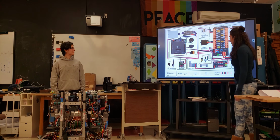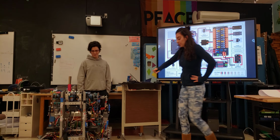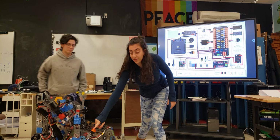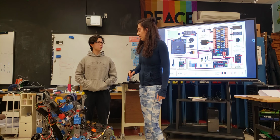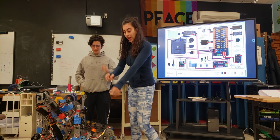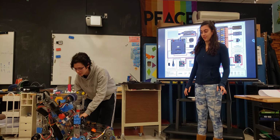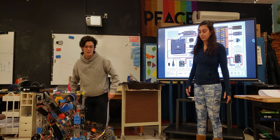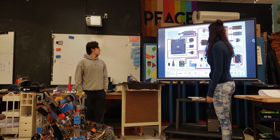So, there's a lot of other things on here that probably not everybody has to know. Like this light. Okay, this light is important. This light, if it's flashing, that means the robot is running and it has code running on it. So don't try to fix, like, screws or something while the light is flashing, because that's important too. If I'm fixing screws over here and the arm is running, it's gonna hit my head and I'm gonna be very sad. So that's why you want to back off the robot when it's enabled. Yeah, that light is important.